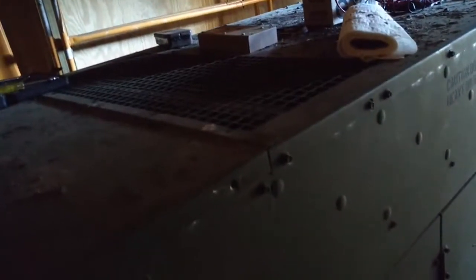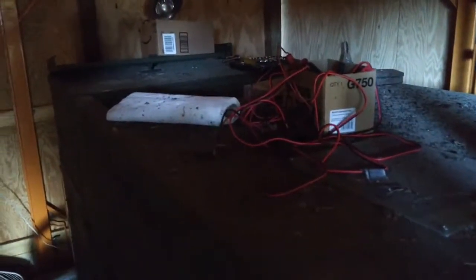The system will sit here idle until it loses power. That's when the manual start applies. The automatic start — the only difference is when the house loses power, it goes through the start sequence without confirmations. So if the family's out of town or just don't feel like coming outside in a storm, if they lose power, this thing will go through the start sequence and send power to the house automatically.